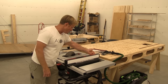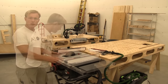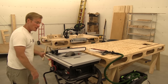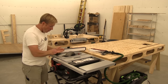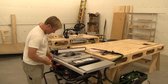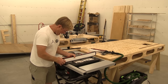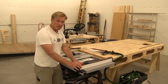There is some deflection if you push on the fence end, but if you're a carpenter, real world, you know that does not impact your cut. Most of my cutting is done with the narrower setting, but if I want a wider cut, it's just a matter of flipping a lever and moving the rails all the way out until they stop. You go all the way out — not midway. That's what calibrates the tape for your wider cuts, which go out to 26 inches. Then you lock it down, and there's a double scale — a red scale and a black scale — and you start reading the red scale to cut out to 26 inches.